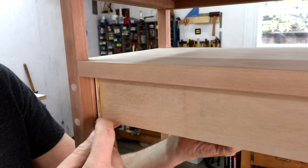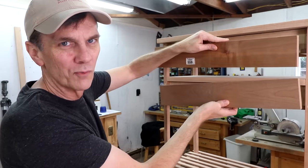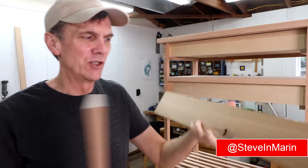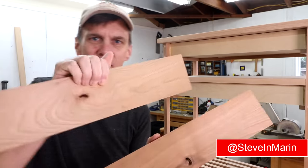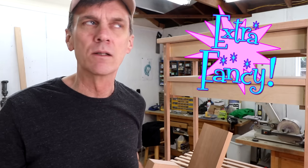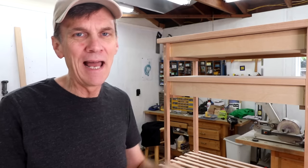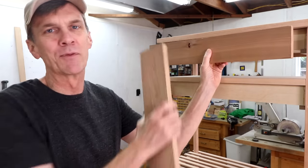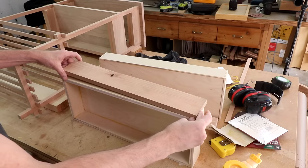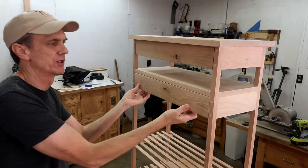The drawer slides back just a little bit further than the runner, so when I put the face of the drawer on, the runner itself will act as a stop. These are the two boards I'm going to use for the drawer fronts, and I had a decision to make. I asked followers on Instagram to help me decide: use the clean side of the boards, or show the knot holes which add some rustic charm. Over a hundred of you left comments — it was about half and half, but the majority wanted the knot holes showing. So I'm installing them that way. I'll glue the faces on flush with the top of the drawer. With this lip underneath, there's no need for a drawer pull — you just reach underneath to pull the drawers out.